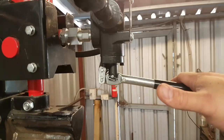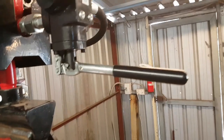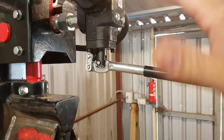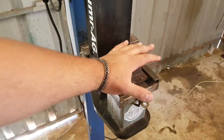It's got a spring feed and lock return. That means that when it's turned on, you can drop the die by hand, but if you let go it stops, and you can lock it in the return position so it'll go all the way up to the top. That's a safety aspect so that you can't lock it going down when you've got your hands in the way.